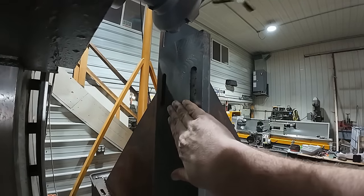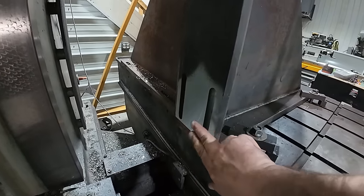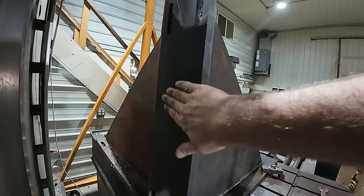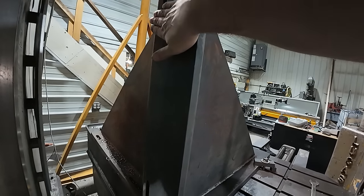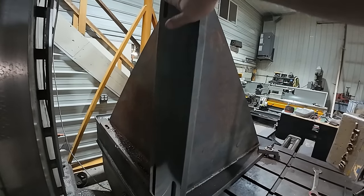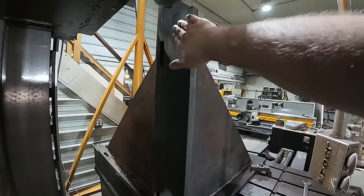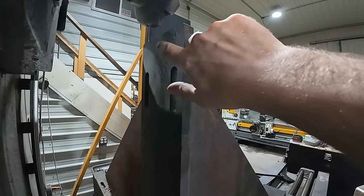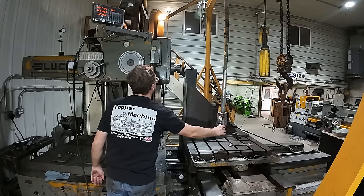I was surprisingly 100% expecting this. Where it was clamped to the table is flat, and there was a hump in the middle. So I bet you we'd get this with another 20, 25 thousandths. I'm gonna slow the spindle back down to what we were before because I had quite a bit of chatter up high, and we'll just take that out.